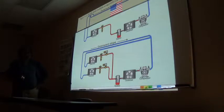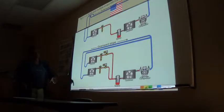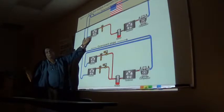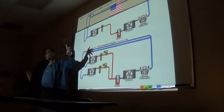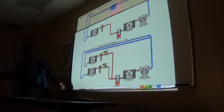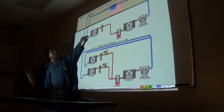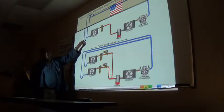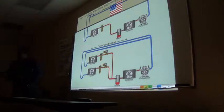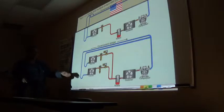So these are here for when your load is varying from hot pull down to holding. In holding, I only need one of these risers. During hot pull down, both of them are in operation, because you have more refrigerant flowing through.